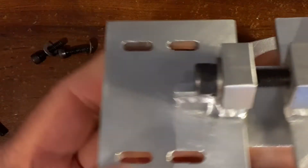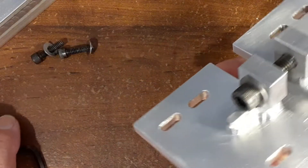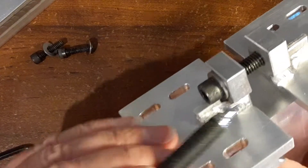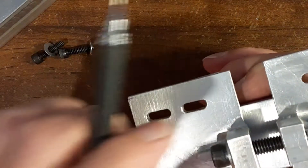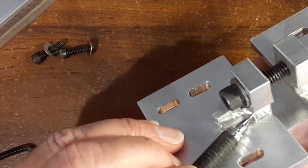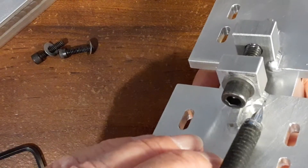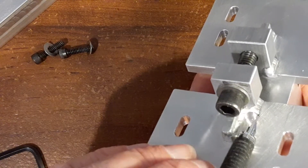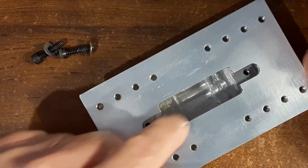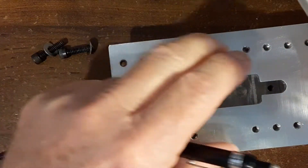This is that one I had welded. What I did was I undercut it — it was a half inch diameter — and I undercut it down because I knew when they welded it I didn't want a straight cut all the way down. When it's welded it has to fit into these slots. These slots are just for alignment; they kind of hold it steady. So I undercut it.